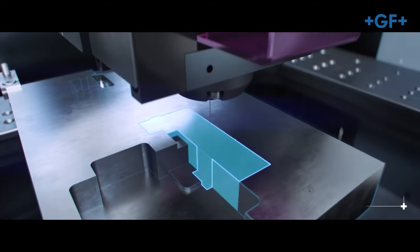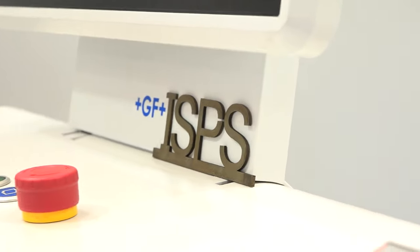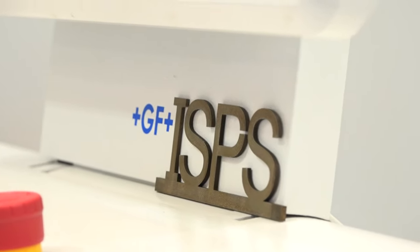So let's actually have a look at the part here then, Mark, and what you're actually cutting out, and explain why you're using this as the demonstration. Yeah, so we're using this as a demonstration because really even the logo of ISPS can show us varying cut heights, very poor flushing condition, i.e. we're only taking a 2mm sliver, and we're slicing straight through that section with one technology database. And of course you can see you're then cutting to various heights. There's a lot freer areas of cutting and also a lot more intense areas. Yeah, so it's a prime example of what is showing the Spark protection, but also what is the iWire function, how we can save wire during the process.